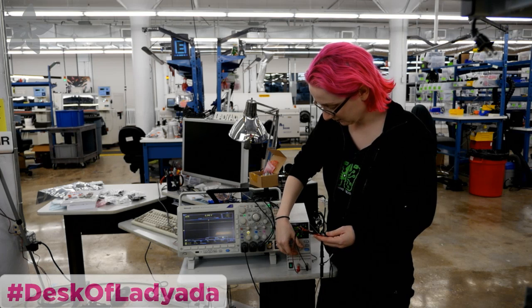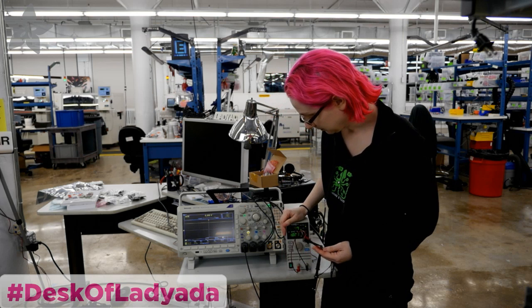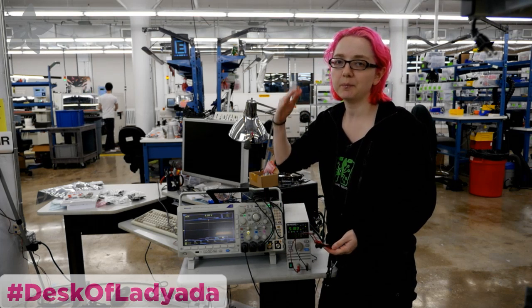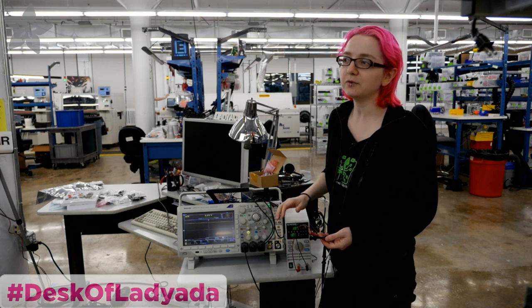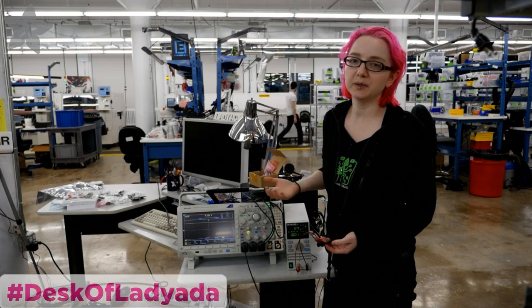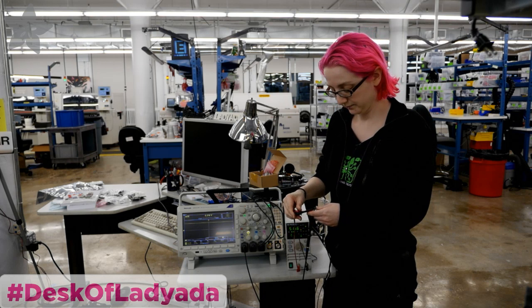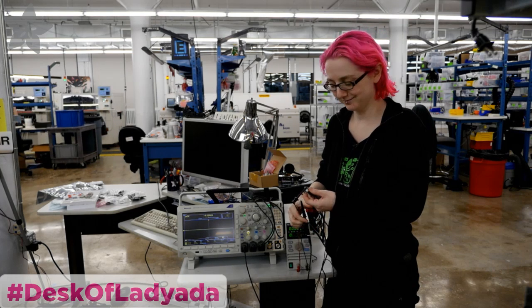Do you want to answer a question? Sure. So if I understand it correctly, the electronic load is just drawing more and more current so that we can see how well the power supply can be? Yeah, basically this just acts like a gigantic resistor, but it's a programmable resistor. As you tweak this up, it will programmatically draw more current, so you can test it under various current loads — for testing boost converters, linear regulators, or batteries, seeing like if I actually draw 100 milliamps, how long does the battery last? It will just sit here and draw exactly that much current. That's my demo. Thanks everybody — that's what I do during the day.